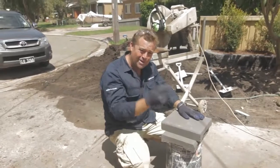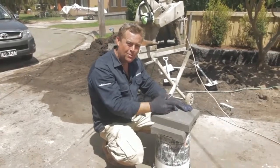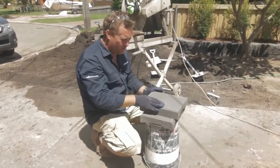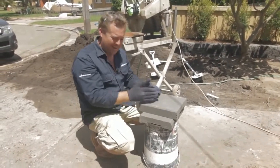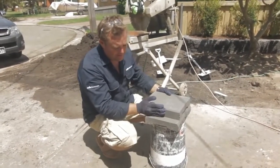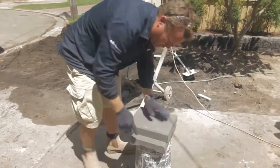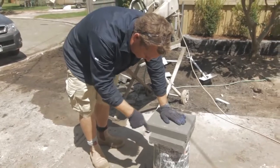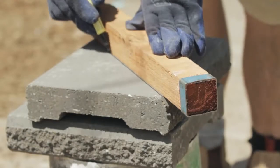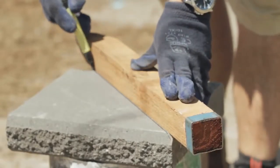We've managed to build the whole wall and only had one cut — cutting a block in half so we can start off and finish with stretcher bond. But when it comes to the capping, we need to get miters in the corner so it looks like a professional's done it. The blocks are longer than they are wide, so if you went corner to corner, you'd get a cut touching at the outside with big wide gaps at the back. The easiest way to do it is without a tape measure and without a ruler — you just find the corner of the two blocks and line it up. Where they intersect, you make a mark there and a mark in the corner, cut that off and do the opposite on the bottom paver, and what you're left with is a perfectly married 45-degree joint.